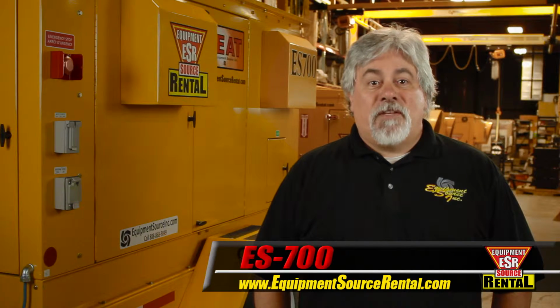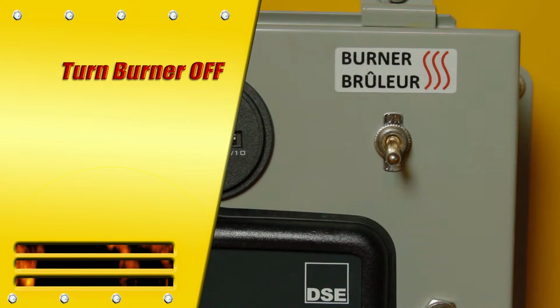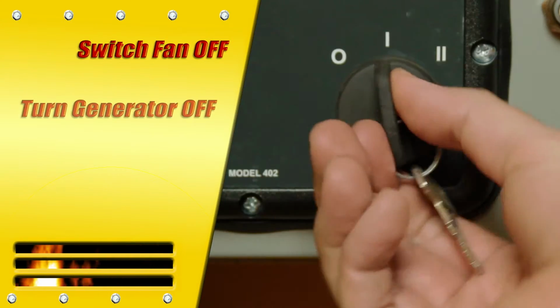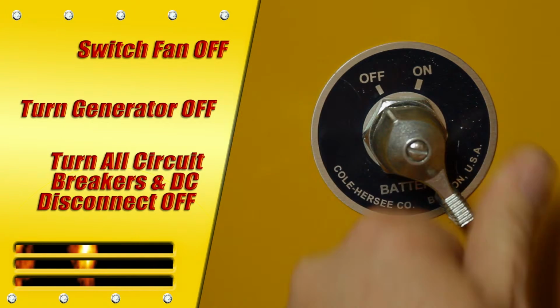To shut down the ES700 heater, first, shut down the burner by toggling the control switch to the off position. Next, let the blower fan run for 5 minutes to cool the burner, then switch off the fan. Turn off the generator. Return all breakers and the battery disconnect switch to the off position.